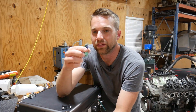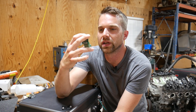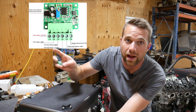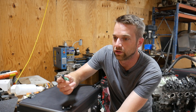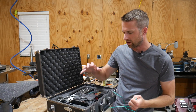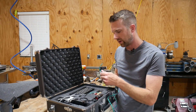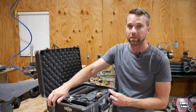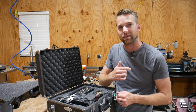This one has a different frequency range, but it's similar to the frequency-to-voltage converter I mentioned. The wiring is really straightforward — you give it power, you give it a ground, you give it your frequency input, and then it puts out its own voltage signal. With all that covered, I'm going to kick off a box modification montage. These wires were just for testing purposes. I'm going to add another bulkhead Deutsch connector here, then stick it back in the car, dial in that voltage-to-RPM relationship, and keep things moving.